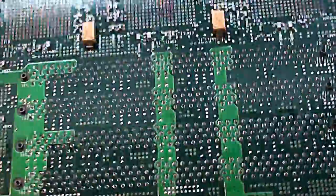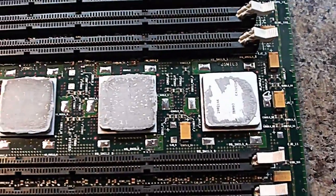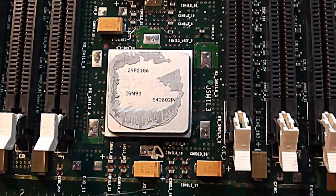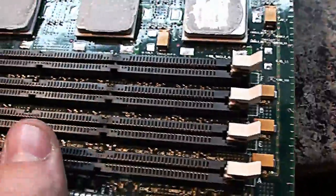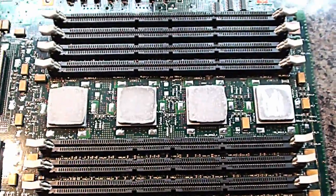On these smaller chips, these look like just standard BGA chips. These will be for controlling the memory. They're all going to be identical, so I only took the heatsink compound off one of them. None of the part numbers are giving me any information whatsoever, but based on the location, the quantity, and the pinout, I'm absolutely certain these are going to be for controlling the memory.